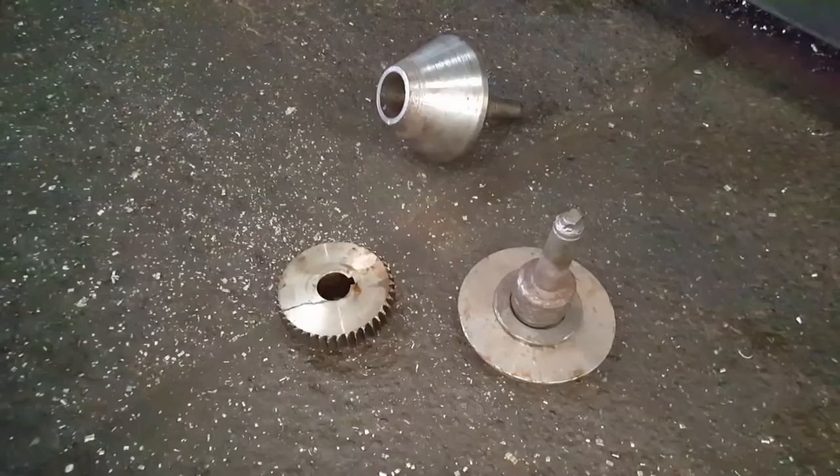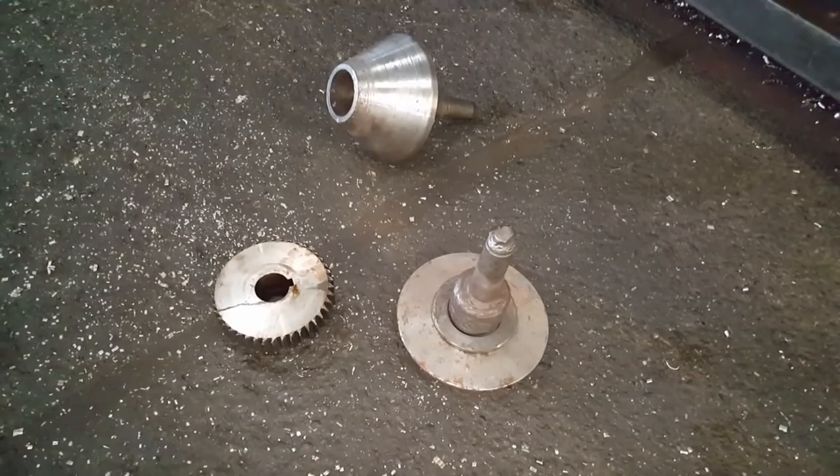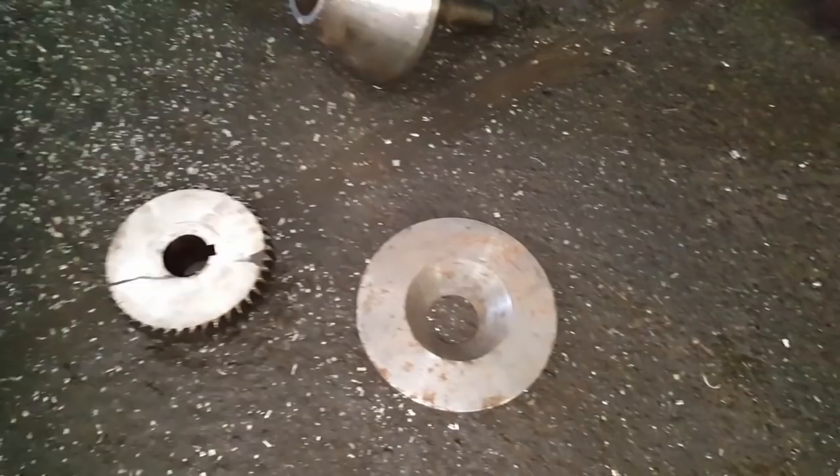What I used to do years ago when turning tubes that have got a big hole in them - this is the biggest cone I had, and it just fits in there. That's just the right size to make a sleeve for this. I've made three of these tools on various lathes, so I'm going to use that. I'll set it up in the lathe and start roughing it out.